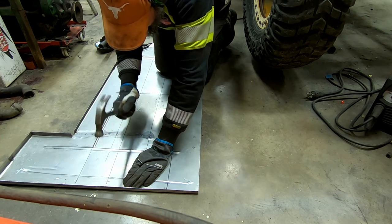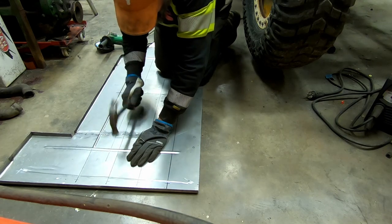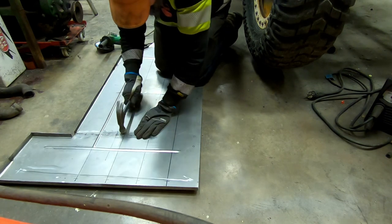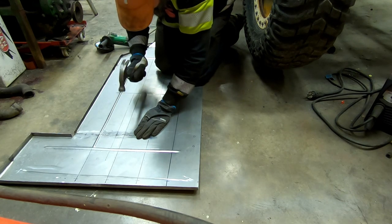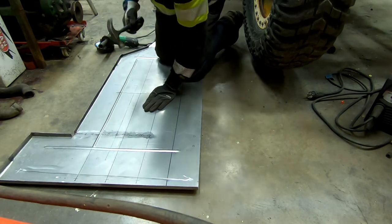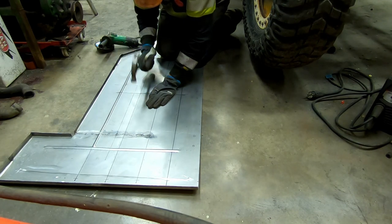So this is what I did — I need to stretch the metal a little bit where the beads are going in, otherwise the metal will be very flimsy. I tried hammering it on the concrete floor and it worked out quite well, actually better than I thought. An ordinary carpenter hammer on a concrete floor did the trick.